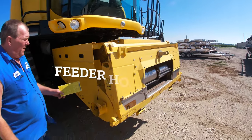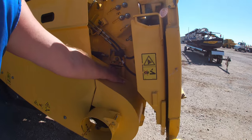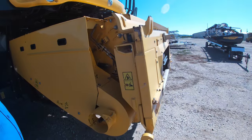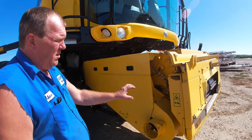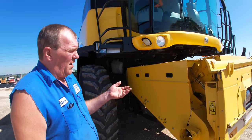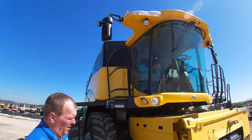The ASP feeder house drum height has been really crucial. We normally always set the height on number three for beans and crank it up to five for corn. If you know you don't have any rocks, we've gotten by at four and run corn and beans in that setting. If you're going to run a 30-foot bean head and a six-row corn head on this combine, set it to three and just leave it - just change your sensitivity on the older machines.